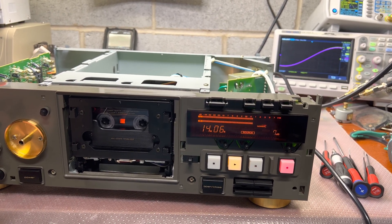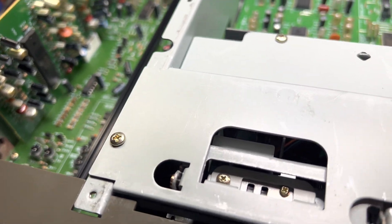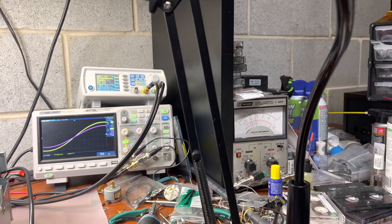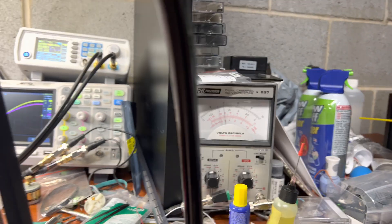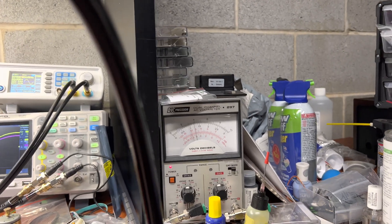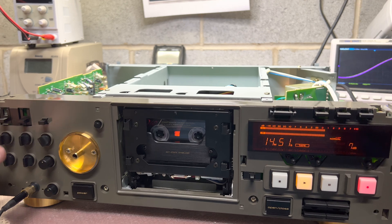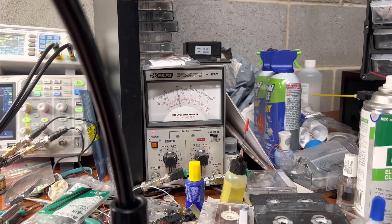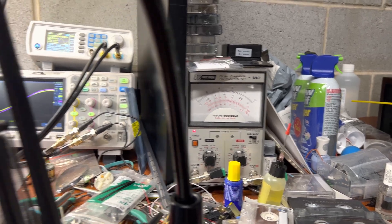Two decibel difference. Can I adjust now? Yeah, now it works. Source, tape — let's be precise. One channel: source, tape. And next channel: source, tape. Source, tape — good. Source, tape — 400 Hz, we're recording perfectly now. And we will have enough range. Plus three decibel and minus four decibel. Left: plus three and minus four. They're both balanced.